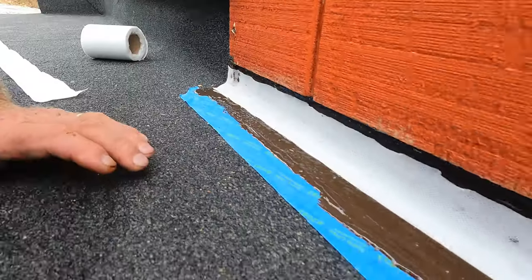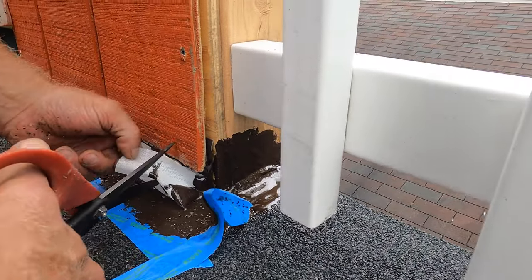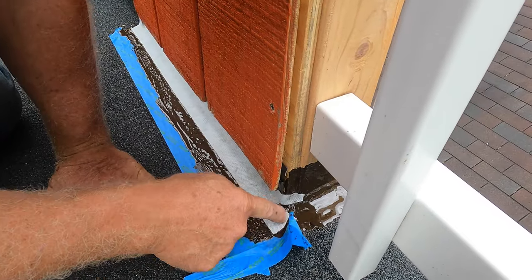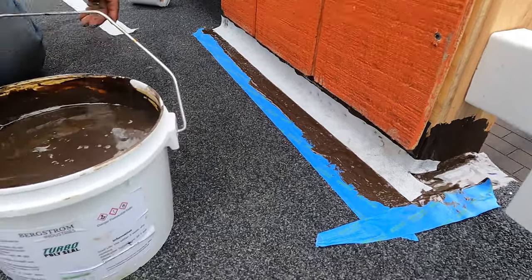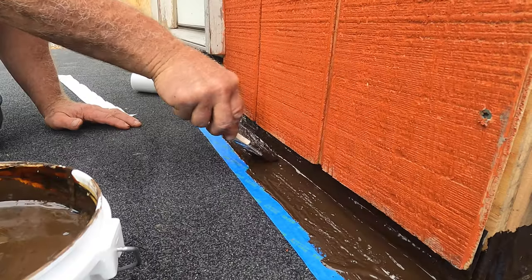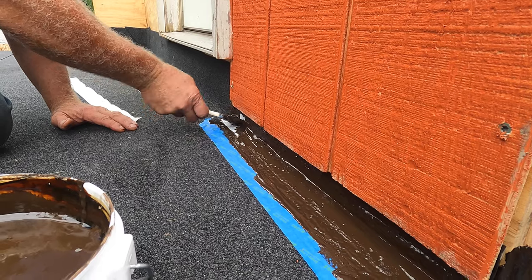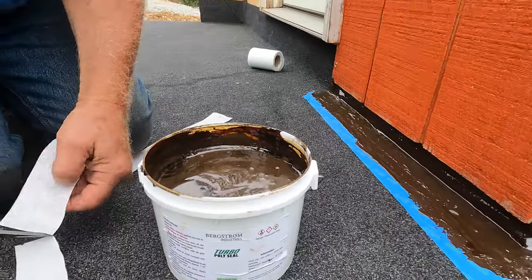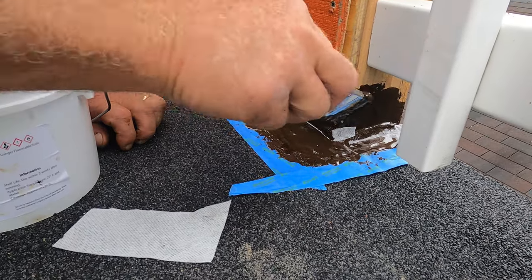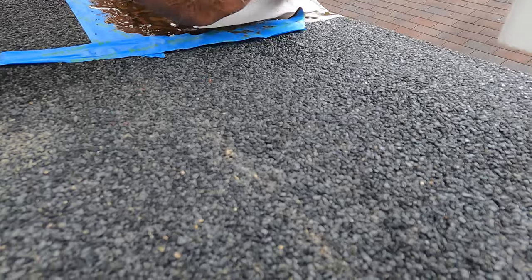I'm covering that — this is super, super nice and easy to do if you have this type of flashing to take care of. Cut that corner, go around the corner like that. Then I paint the Turbo Poly Seal again over the fleece, because that's what makes the strength — that fleece is very, very important. This cures in 24 hours, but you can paint over this Turbo Poly Seal within an hour, and it can rain within an hour after you did it. When you go over another transition like that, you put it over the fleece just like that.